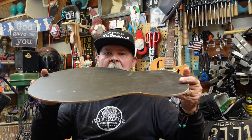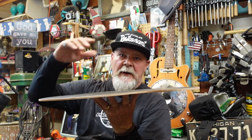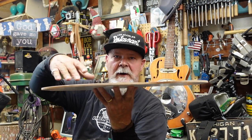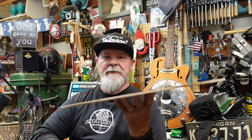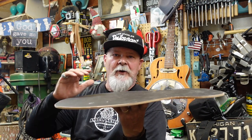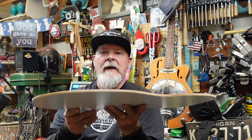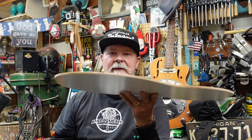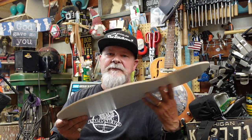So I think you're smart enough to know that we can take something that's cupped, and if it's this shape, we can put that cupped thing like the back of an Archtop guitar. Instead of clamping it to the body of an Archtop guitar, you pull that back off, you set it up here, and if it raises up, after I drill a hole in here, I can inject steam up through here, clamp this down, and bring it back into shape without depending on the deformation of the body and sides of said Archtop.